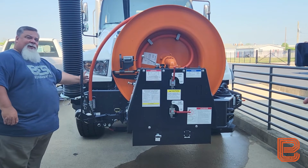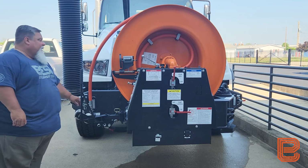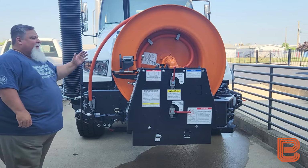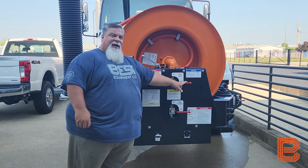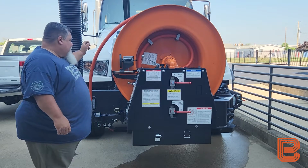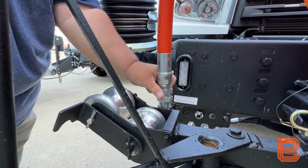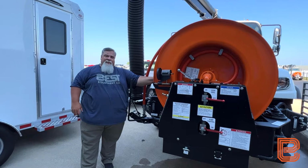Once I do that, I'm going to have a steady stream of water coming out of the bottom of the transport coupler. Once I start getting air and water mixed out of that section, I'm going to come up here, I'm going to close my hose reel ball valve to the off position, disconnect my rotor hose from my transport coupler, and we're going to secure that to itself on the reel.